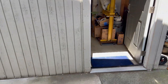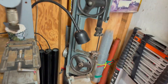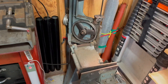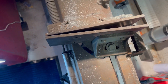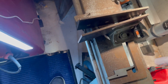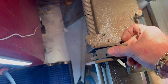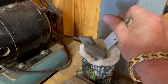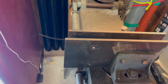Now the last thing is in the shed. Most of you probably know this, but on these bandsaws — I've had this one for over 30, 40 years, it's fantastic, very little stuff to do to make it worthwhile, the motor's still good. I added these plates. But if you clamp something here and tighten this, you get that. What you do — if you haven't figured this out yet — get a set of adjustable parallels, cheap ones. You open this up in here, then lock it down, and it locks any size. I've got all the different sizes for whatever I'm going to cut. It's quick. I used to have screws with holes but it took forever to screw in, going from something small to something big. That's a little helper.